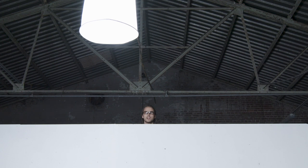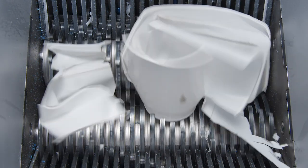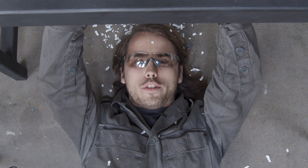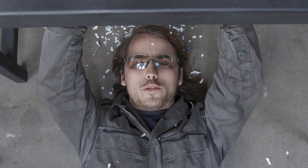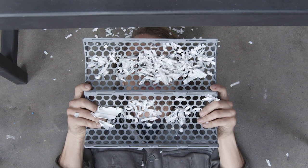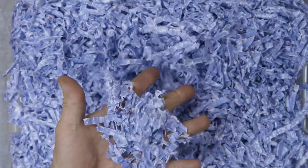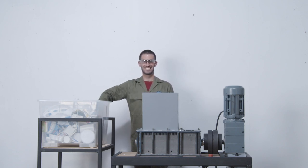So your plastic is sorted, now it's time to shred. When shredding, you have the choice of how big you want your plastic flakes to be — large, medium, or small. You can control this by swapping out your sieve for different sized meshes. Different machines use different sized flakes, so it's important to mention which size you're offering when selling your plastic. Check out the download kit to see which size each machine uses. In general, the smaller the flake size, the more time and energy it takes to shred, so be sure to take that into account when choosing which size to go for.